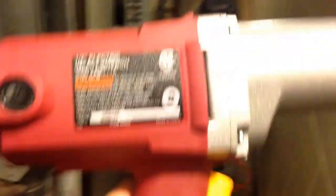So in order to get to that, you've got to take your belt off, take off this upper pulley, and then just pull the bolts out and get that duct out. This is to vacuum out up top here and then down through there and that whole ductwork. So in order to get that off, we've got to grab our electric impact and see if it's on there.